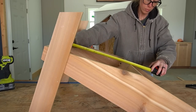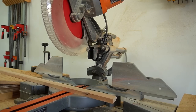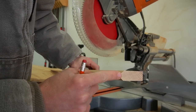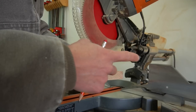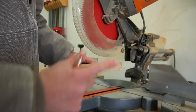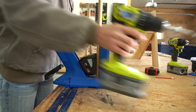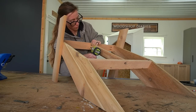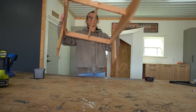Once the frame was together, I double-checked the distance between the two 1x3s — it should be about eight and a quarter inches. So I cut another 1x3 piece to that length with the back end mitered at 15 degrees. My 1x3s were actually ripped from 1x6 tongue-and-groove boards, which are much cheaper than 1x3s, so that's why you'll notice the little tongue on them. I installed this using pocket holes and screws, though I did have to use one regular wood screw at the back because I drilled my pocket hole too close to the edge. The seat framing is now complete.